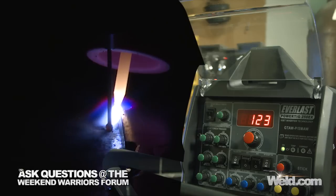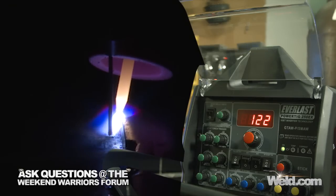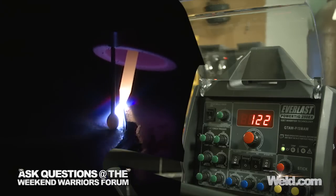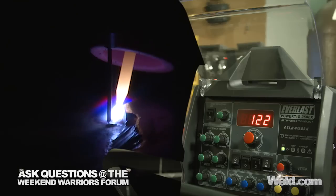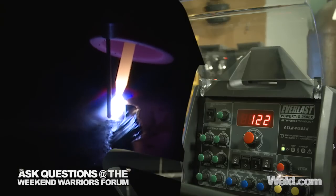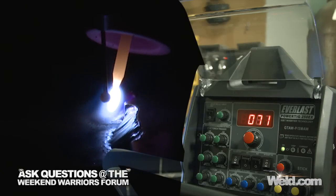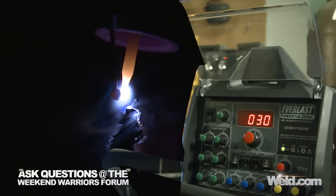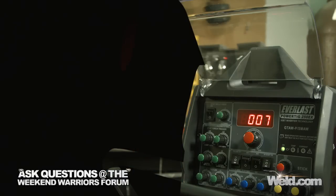When you're doing steel, especially unclean steel, there's a little decarb layer on there, and it just takes a little more to punch through it. I'm going to go ahead and terminate this weld, let off the wire, back off the amperage, and then taper off slowly. I still got post-flow argon on there.